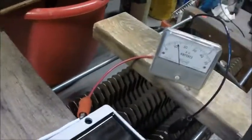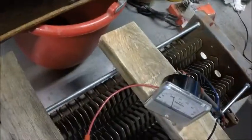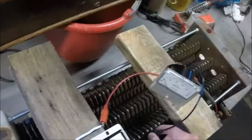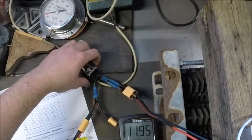That's 12.5 amps at 12.05 volts. That's 11.5 amps at 12.08 volts. And when you remove the load rapidly, it doesn't jump up or do anything weird. It doesn't seem to surge poorly or anything.